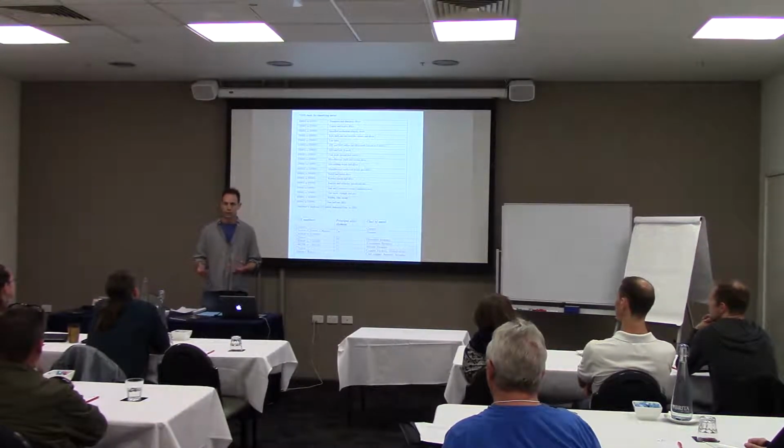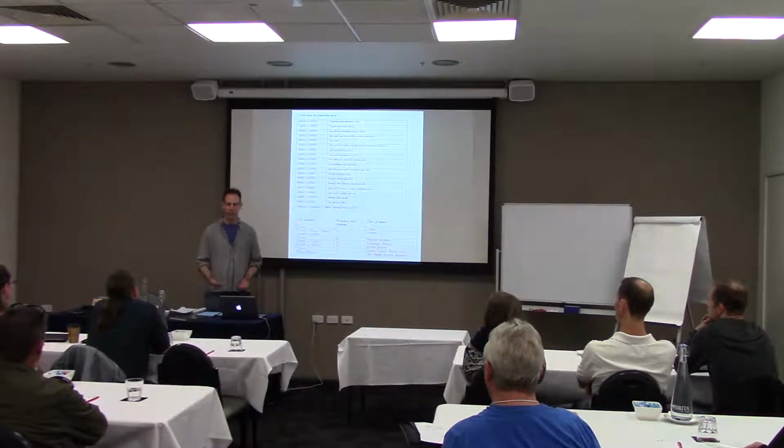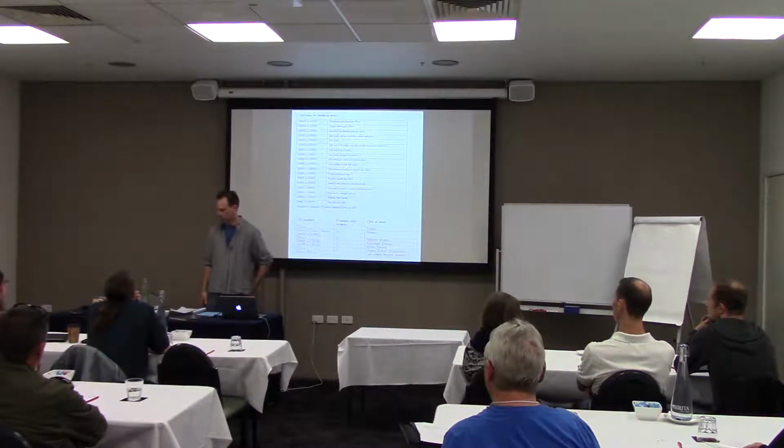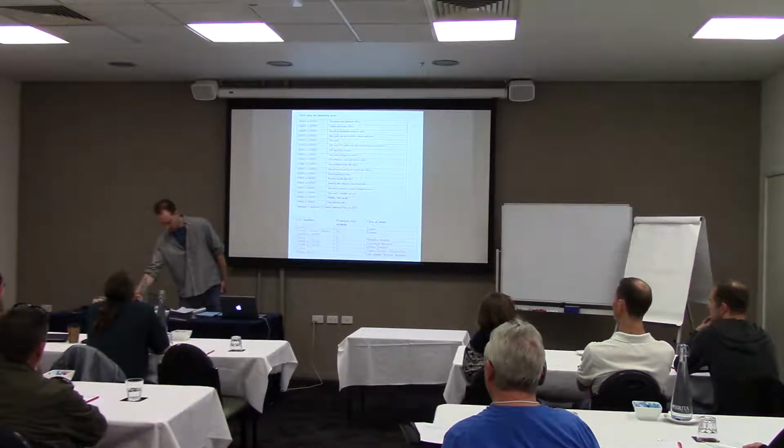We add lead to some brasses to make them machinable, because if you were to take regular sheet brass and try to cut threads on it, it's very brittle. It's not fun. So 360 brass is what you would be using for machining. 260 brass is usually what you use for regular cartridge brass, which is what we use for horns, bells, branches, necks, that type of thing.